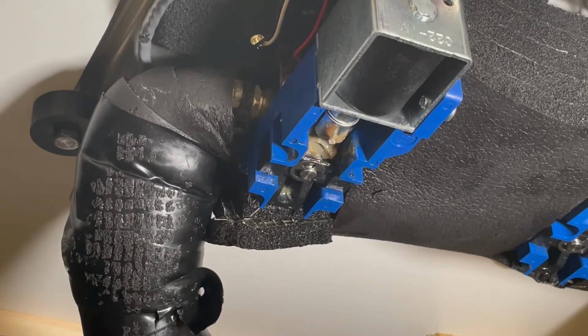If you have a long draw system, which means you're running from a keg room up to the bar, untap the keg and the cooler, and then go back up to your dispenser and do the same thing. Put the dispenser into prime or purge mode, push down the cup coupler, hit the start button, and any extra pressure and beer will be dispersed. And then you're gonna want to hit stop once everything's out.